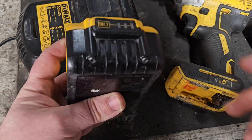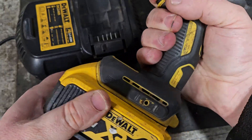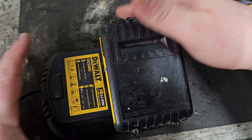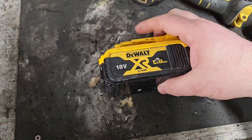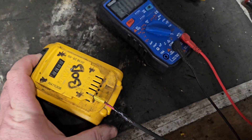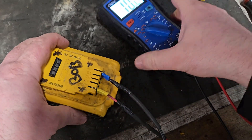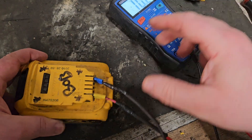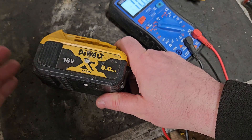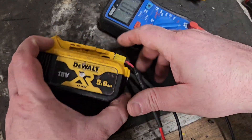Hello and welcome. This is a familiar sight to all who watch my channel — a DeWalt battery that doesn't work properly, doesn't power a tool, will not charge. However, this one doesn't add up, and I'll show you why. If you put the voltmeter on it and measure the voltage, that's about 10.2 volts. That's not a very high voltage for an 18-volt slash 20-volt fully charged battery. When you have a low voltage battery like that, it tends to mean there's something wrong inside.